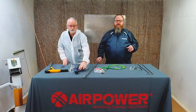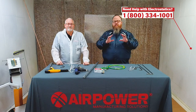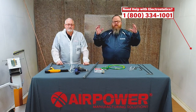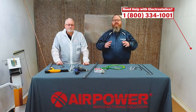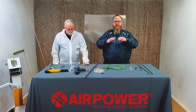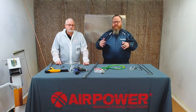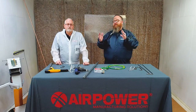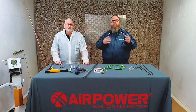All right, let's talk about a few things here. We want to talk about electrostatic or E-stat painting and powder coating, things that are important to consider, not just the application of spraying, but things you need to consider. When you are using electrostatics, it is very critically important that the area that you're spraying in, your environment, is very clean. We're charging particles, right? So if we have other particles that are floating through that could possibly pick up charge, you have a higher potential part contamination as they're moving through the line or going into the cure cycle.